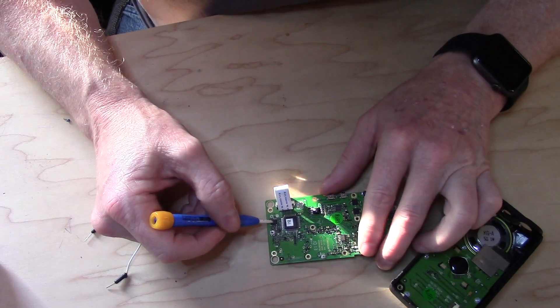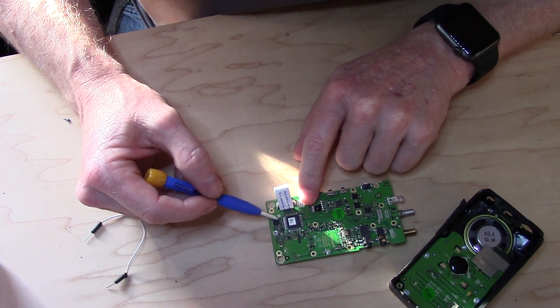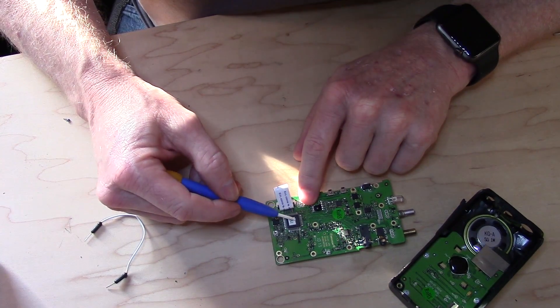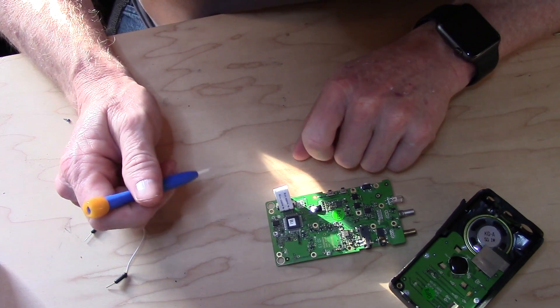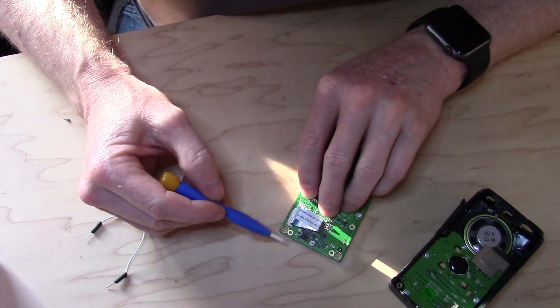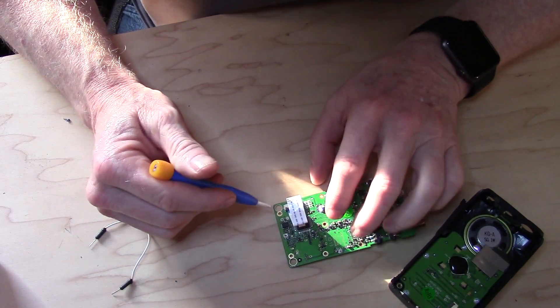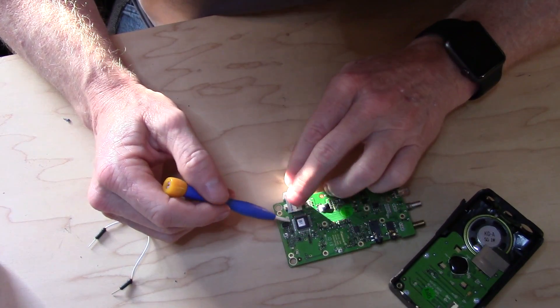This is usually the problem - I've covered this in a prior video. The EPROM that usually comes in these will only go through very few write cycles, and unfortunately the firmware actually does write quite often to the EPROM on this radio. This is one I've actually replaced in the past and it worked until the radio got submerged and sustained some damage.